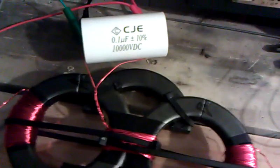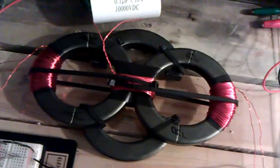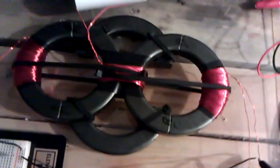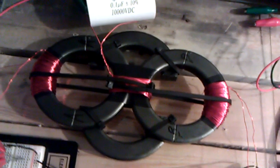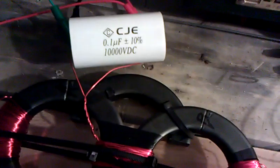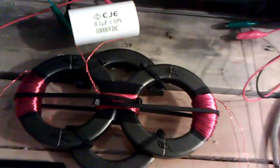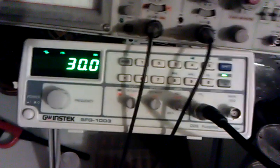So I've got 100 nanos. On Thanes, we didn't actually see them use any tuning capacitors, but any coil and frequency can do better with resonant tuning. So 100 nanos on the 29.5 millihenry primary, and I've got a range of frequencies I'm going to go through and show you guys. Right now it's at 30 hertz.